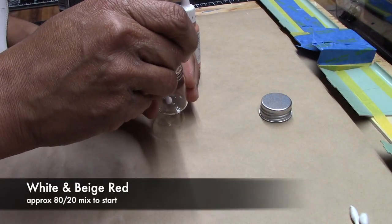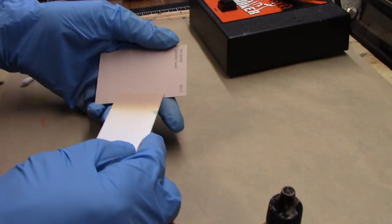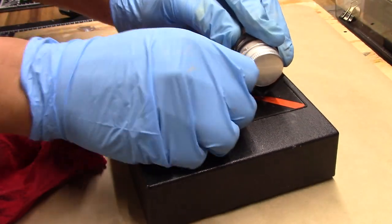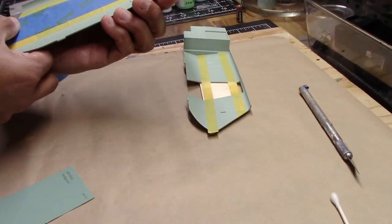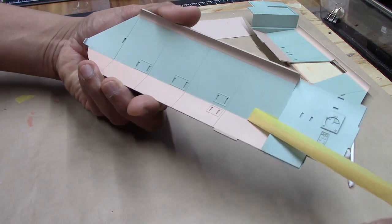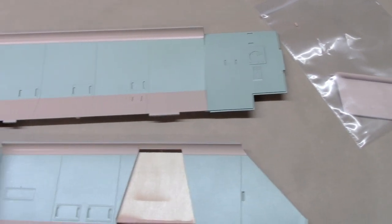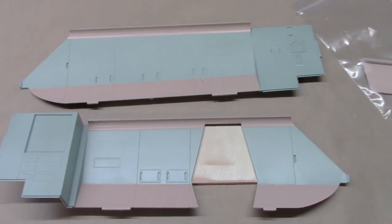Let me show you the mixing process. I'm combining white and beige red to come up with the next color called Likeable Sand. I should have masked off the areas first, but since I didn't, I have a piece of styrene painted with Kind Green to test against. After adjusting the mix, I placed it into the mixer. I ended up mixing two batches — the first came out a bit too dark, so I added more white to make a brighter version, lightly sprayed over the first. In the end it turned out a fairly close match.